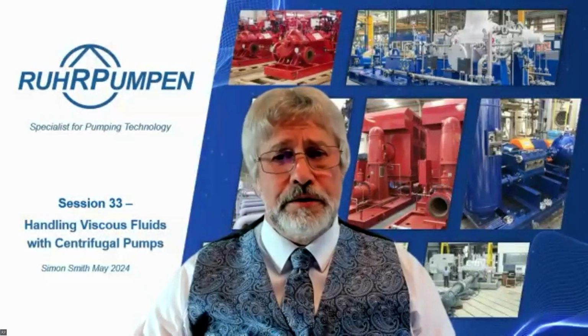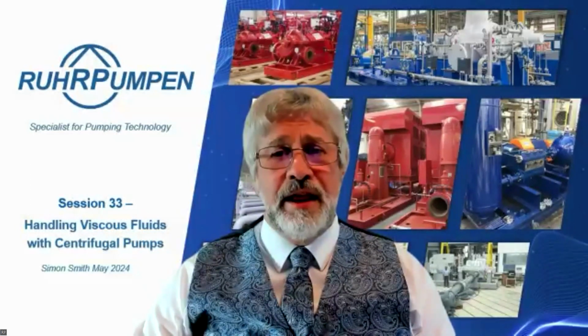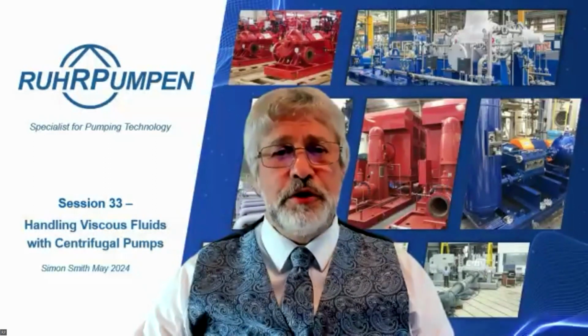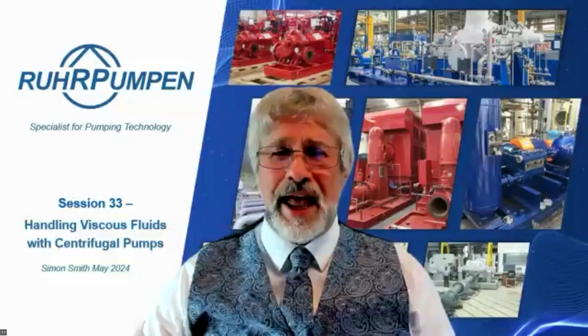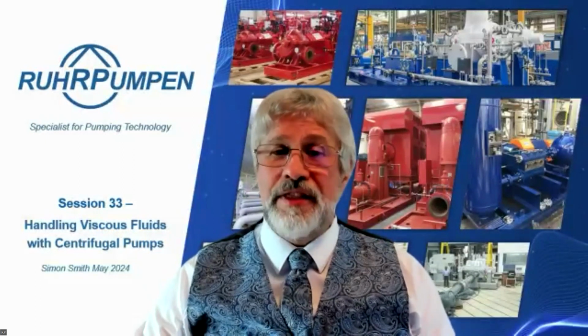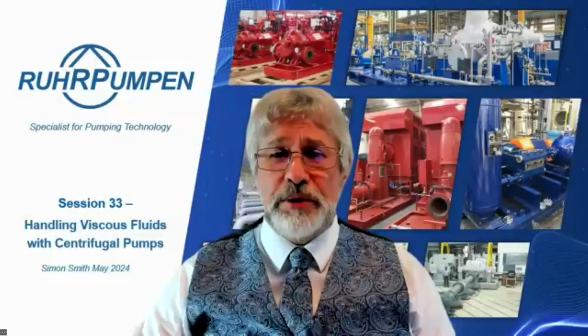Anonymous attendee, is there a standard for the non-Newtonian fluids calcs? I don't know. It's again a very different product. Non-Newtonian fluids are often better handled by a positive displacement pump. Well, you're not churning them around, so they're not getting thinner as you pump them.